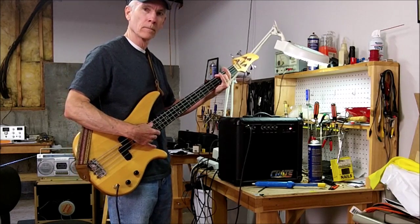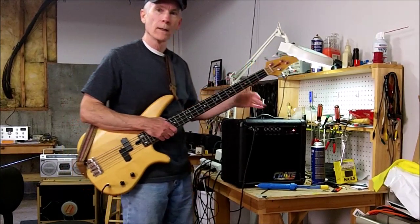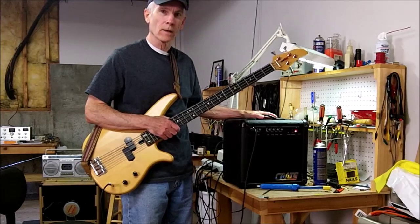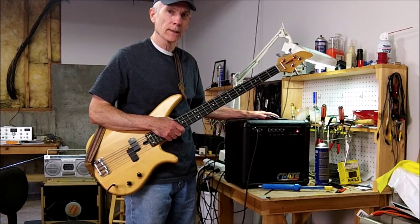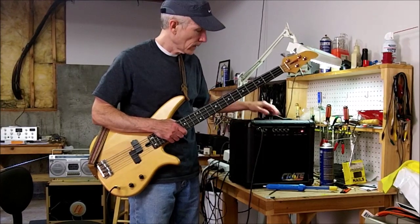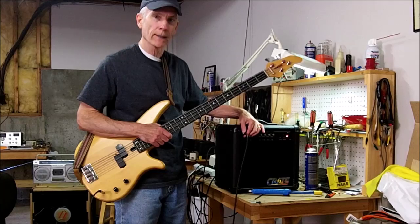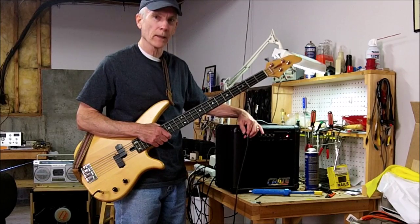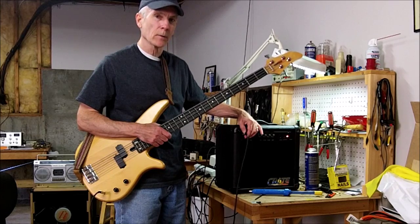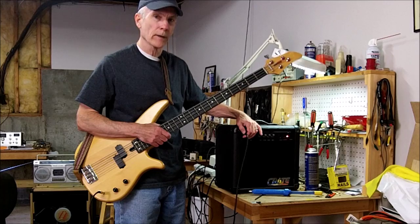it works. So, the very common problem with amps of all kinds are the jacks. So this is a case where we were able to replace the jack and make it work again. Another breakdown point sometimes is the input jack. It might become erratic and you might be able to move the input jack around and have the signal come and go. But as you can see, it's pretty easy to replace the jack on some of these amps, and you may be able to get your amp going again.